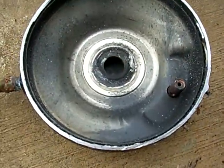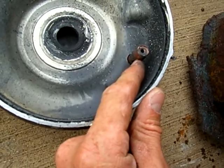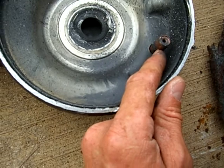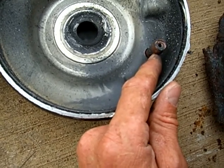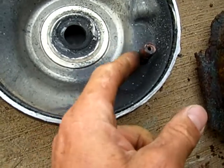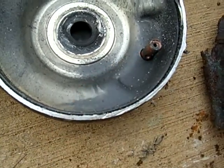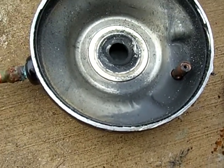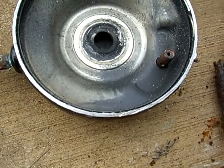And then out the discharge is the whole discharge area. This guy right here I imagine is an overpressure relief — say if you get something blocked up in the expansion valve or whatnot, this would release some pressure back into the suction side to keep things from blowing up, like your evap coil.